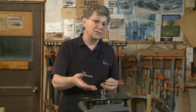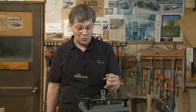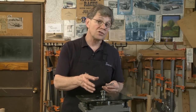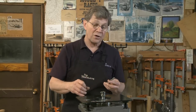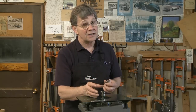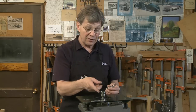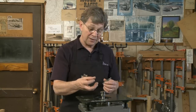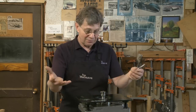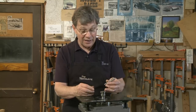These are a product of CNC development. The microprocessor has been really good to woodworkers in the last 15 years or so. One of the motors of choice on early CNC equipment was a router motor, and the industry needed a collet that was a lot easier to deal with than a typical jam collet. So this collet was developed, and what made it affordable and easy to develop was CNC machining — that's the ironic part, which came first, the chicken or the egg.